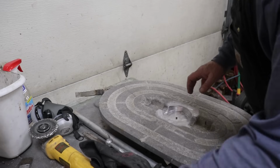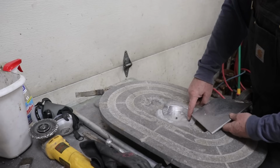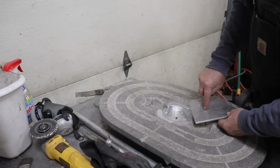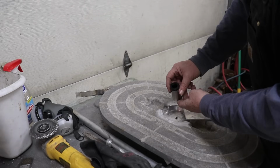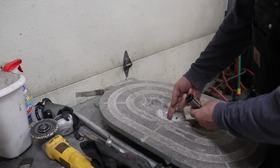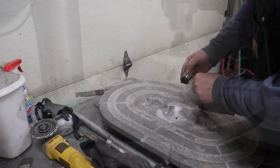take this piece of scrap right here, and I'm gonna hole saw a plug this size to put in there, and then I'll drill through and get a mark, and then I'll cut a hole slightly bigger than the lip of this seal, and then I can weld it to the new plug that we put in there, and we'll weld it all the way around there and create a nice watertight part, and that will recess this also.